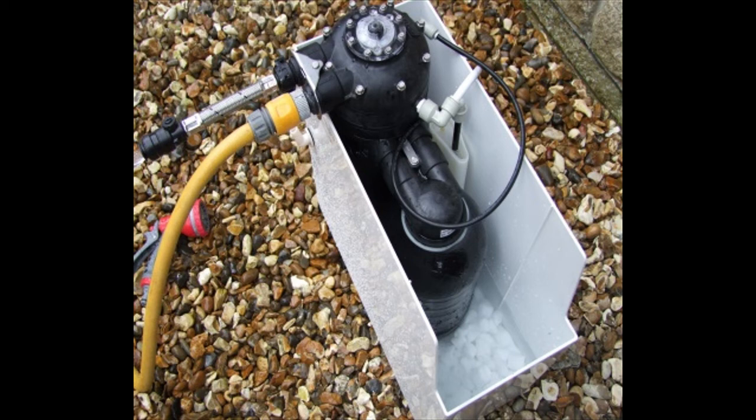So you need to connect your water up, let it run, put some water through on the inlet. Just connect the water up and just let it run through the machine. Don't connect anything else up. Just wash it through the actual control head of the Kinetico, and that will remove it. And just keep running it.